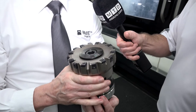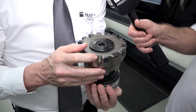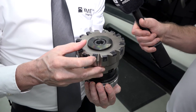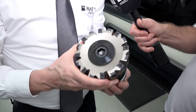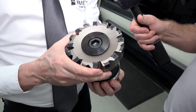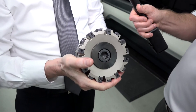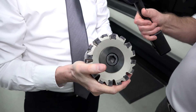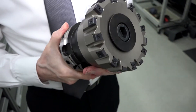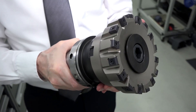Steve: The beauty of this concept is that we've got eight edges on the insert. By moving the insert into this position, we can utilise the full eight edges. So this is ideal for castings with low volume or thin-wall parts. Through coolant — excellent tool — and the results we get with these tools are very, very good against the competition, including the more well-known, established competition.